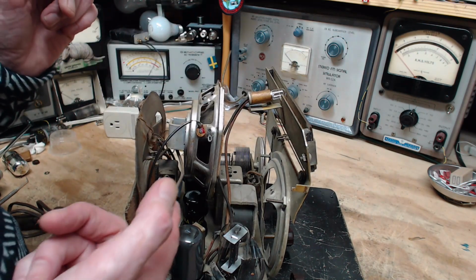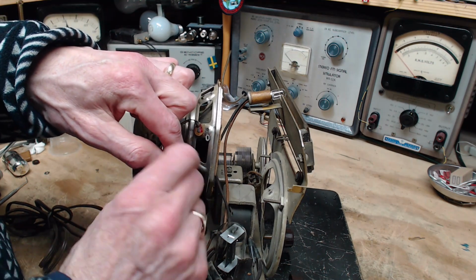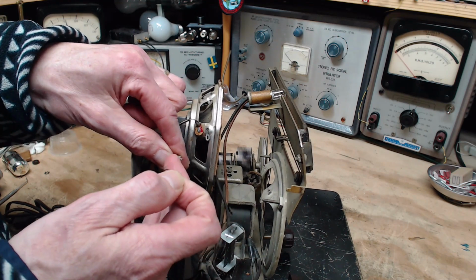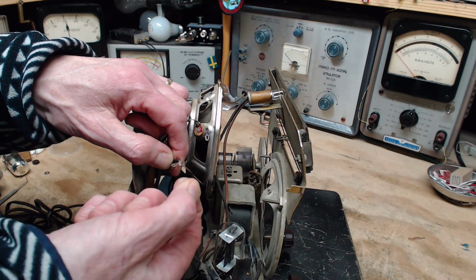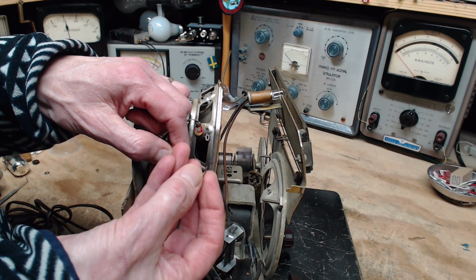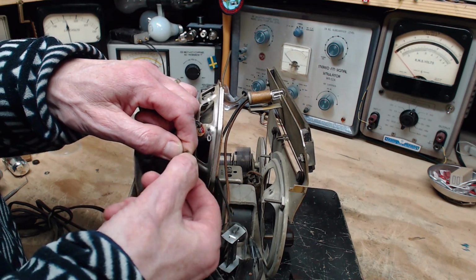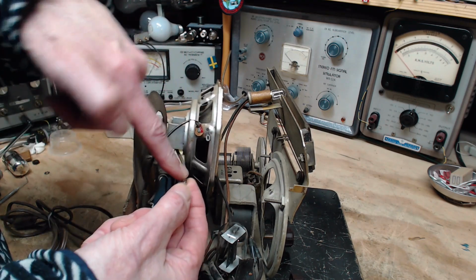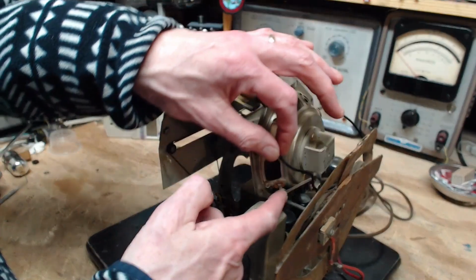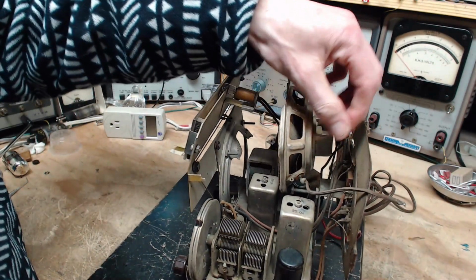Why did he leave this exposed like that? Oh my gosh. This isn't soldered. What did he do there? This is a piece of wire with varnish on it. That brownish color is shellac or varnish. It's not conductive. Oh, this is just barely connected here. But I don't know why you even bother with this piece of wire, because this piece can go all the way over here and make the connection here. Why have this piece of wire? I'll probably connect this here right off the bat.